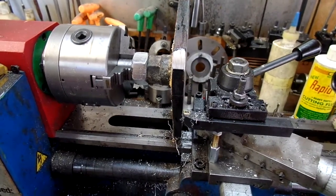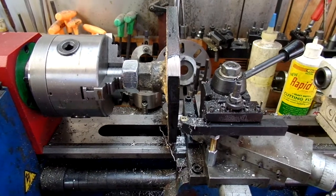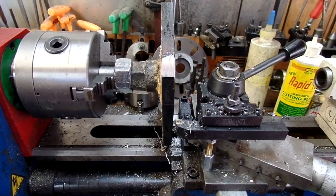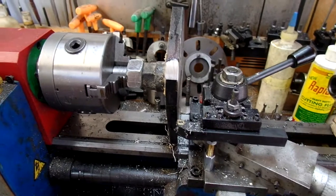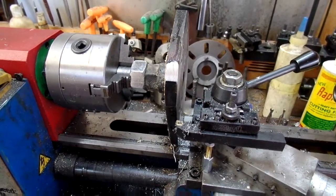They have a six inch faceplate that really is inferior. It's cast iron and the majority of the faceplate is about an eighth of an inch thick. So it breaks pretty easy if you're doing large turning on out-of-balance loads, that kind of thing.